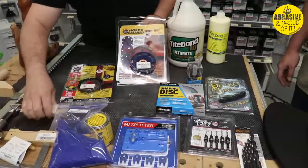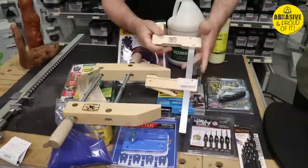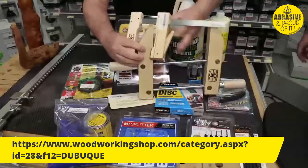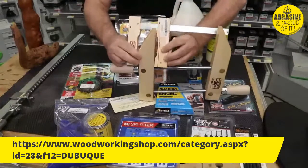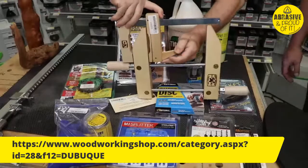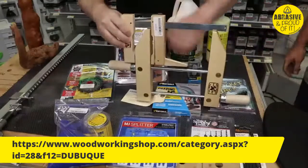So moving down the line, we have some clamps. So yeah, I know wooden clamps, they're kind of old fashioned. Maybe they're out of style, but you know what? They work. If you're trying to clamp something here, this particular one has cork padding on it. So if you line that up close, you adjust this cam, if I can hold the part, you adjust this cam down, and if you'll notice, this opens up and locks on very tight. So cam clamps are just amazing.